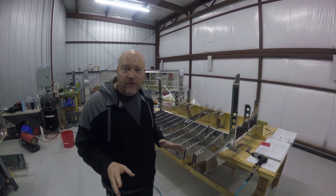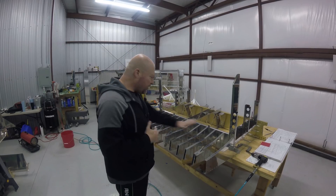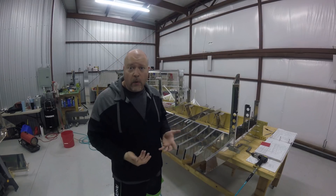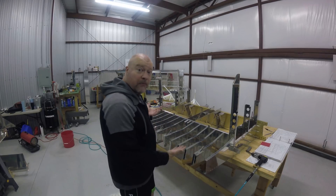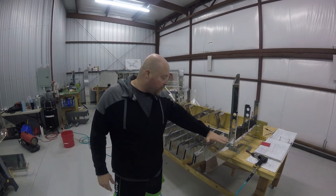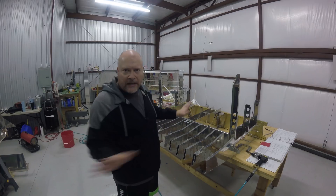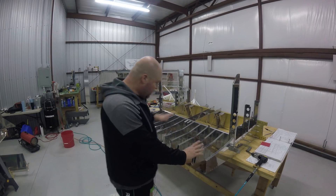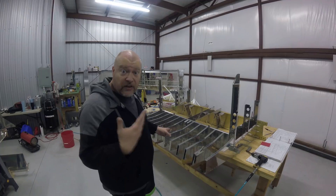All right guys, let's talk about page in review. What I did in the last video was really about preparing these ribs. I talked about trying to get them all flat and get rid of that oil canning. I wasn't real successful in all honesty, but I have put on the bottom skin and the back rib part here and most of that went away entirely. I feel like once I put whatever goes here, it will go away entirely. You have to put together some seatbelt fastener ribs - there are four of them on the back. You're basically just assembling four pieces into a sub-assembly.